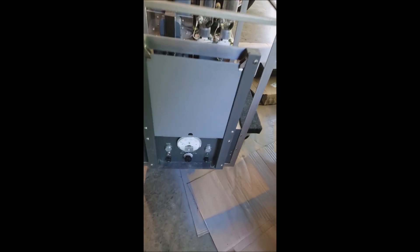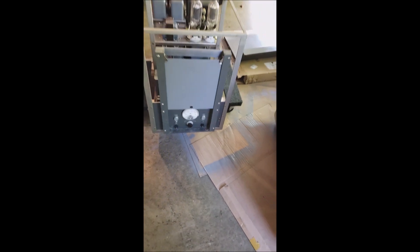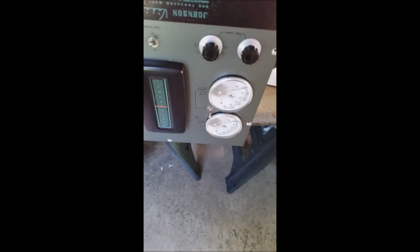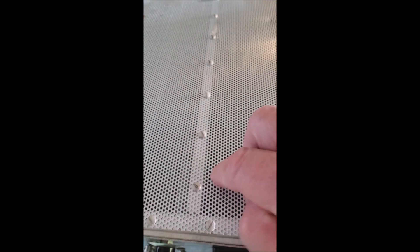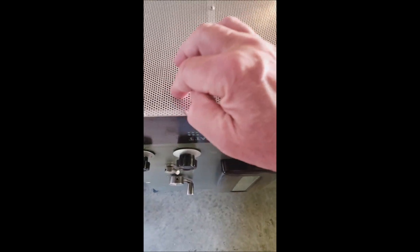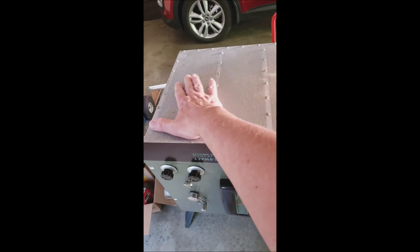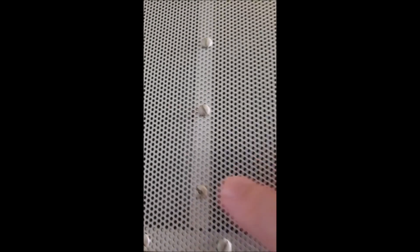Here's the front panel with the controls for the power function. Over here is the setting for the actual amplifier, and I think what's in here is a pair of 4-250s. I did get a pair of 4-400s with it that I can put in if I desire. There's a loose nut floating around inside somewhere — I can hear it, I can see it through the screen, and I've got to take the bottom panel off. I counted 45 screws — typical Johnson. It's going to take a while to get all those out just to retrieve that one nut, and it's right down in this area here.